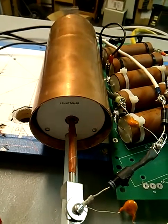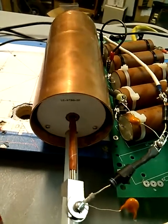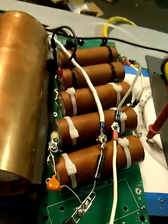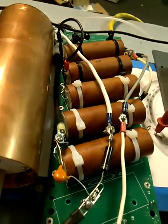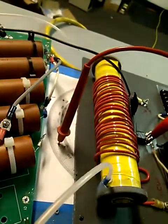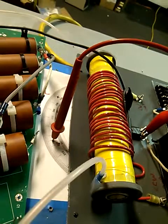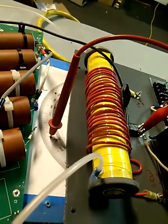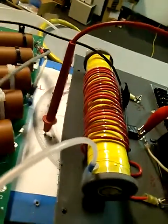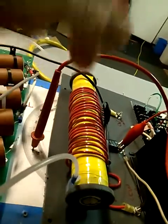What we have here is a spark gap covered with a copper tube — it's a magnetic quenched spark gap based on Tesla's technology. We've got some big capacitors here: 0.145 microfarads at 6 kV out of an X-ray machine, three of them in parallel. This is basically a Tesla coil: 3,500 turns of number 30 wire on a PVC pipe, air core, and eight and eight turns here clockwise/counterclockwise.